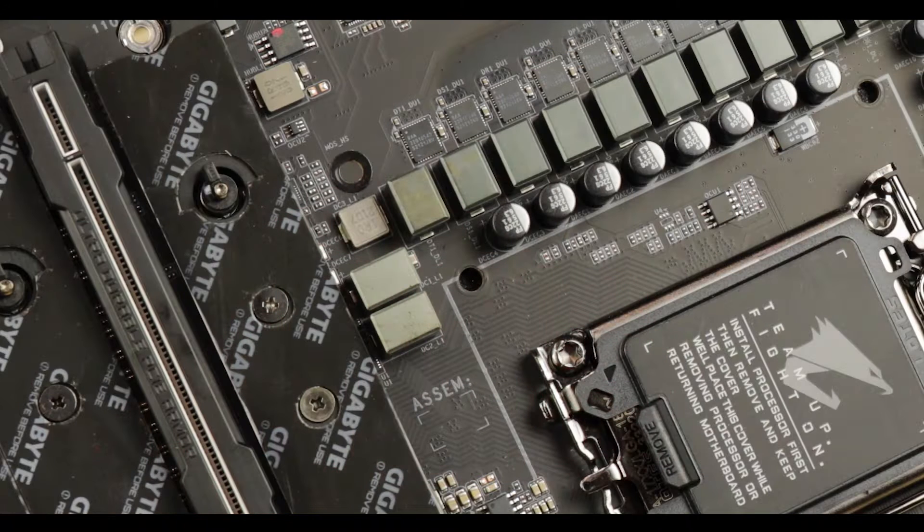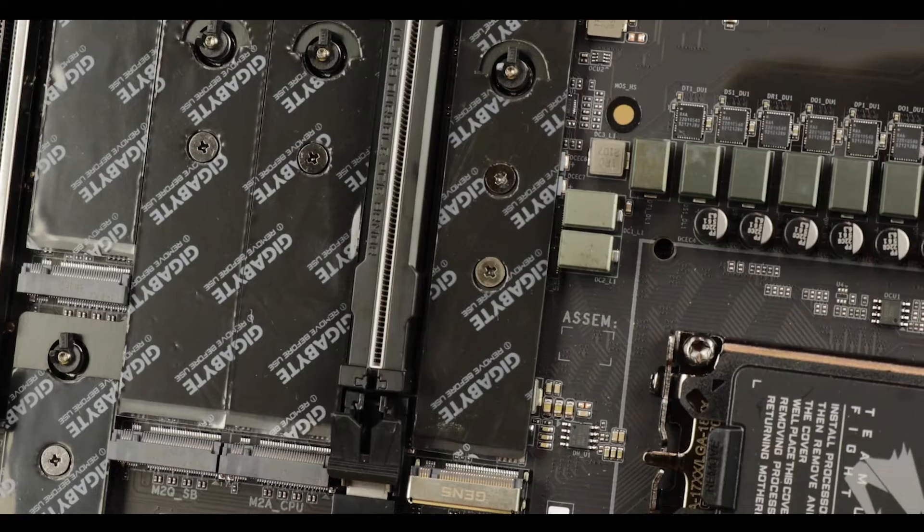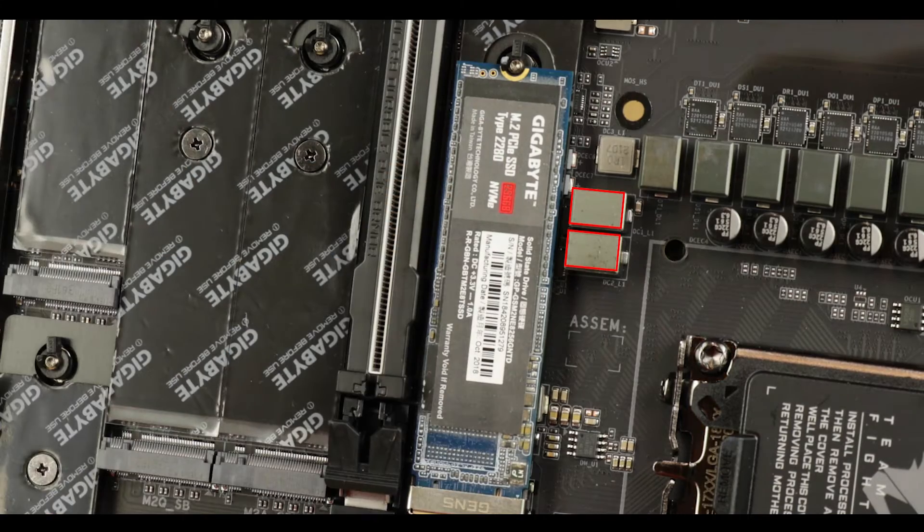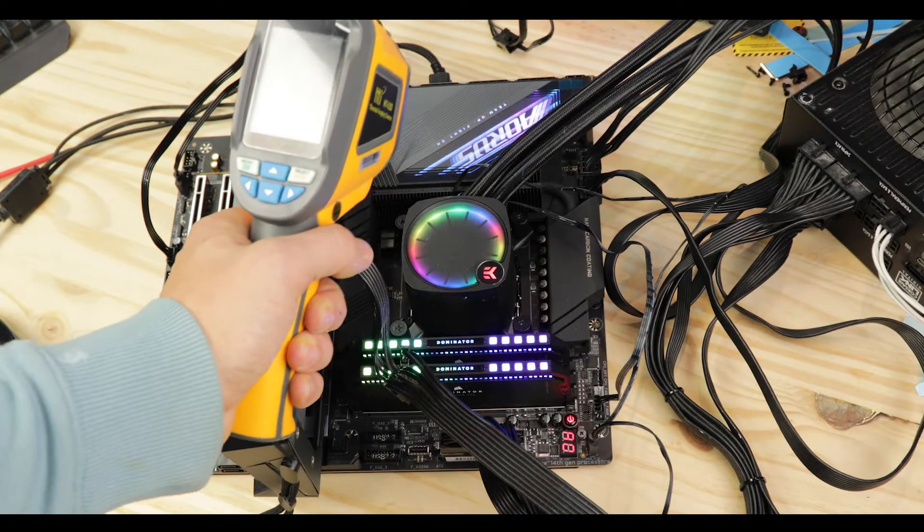What I do love less, and Gigabyte should really listen to this: we have two power stages placed and hidden under what could be the hottest component on our board, meaning the CPU-connected PCIe 5.0-enabled M.2 solid-state drive thermal floor padding. Power stages can get really hot, and even though there are only two of them, I still feel very uncomfortable seeing the motherboard design team going that direction. To be fair, I did not detect any kind of thermal bleeding even through heavy overclocking that would affect your M.2 storage. But just thinking that it is okay is a bad precedent — imagine if they start putting in three, four, five of them. Nothing critical here, but I really see this as a design flaw.